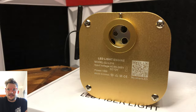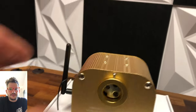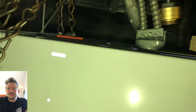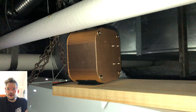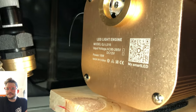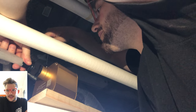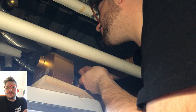Here are the light engines. You can see that is the collar — that's the light source. There's a little set screw where you just put the collar in and then screw the set screw down to secure it in place. Those lights actually rotate, which is what gives these stars the twinkle effect — it's quite cool. There are receivers on that end for Bluetooth and for the remote, and the power supply plugs in right there. These kits were just off Amazon. So you can see that metal collar on the actual bundle of strands just fits right into the collar on the light engine, and we just secure it in place with the set screw. It simply just fits right into that space in the light engine, we screw down the set screw, and once that's tight, that's it. Then we are ready to mount these light engines and plug them in. I just had a scrap piece of wood and we used some Velcro just to set up these light engines in a localized point — they are just a wall outlet plug.